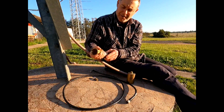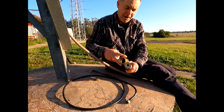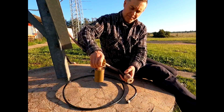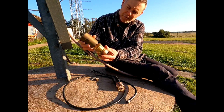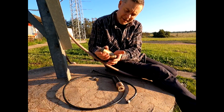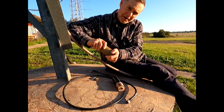The ring on the cable seals it, so it goes on there like that and sits right on the cable. Then the top part comes down and screws in. When the top part comes on, it compresses the little fingers and pushes them into the groove on the cable even tighter. It screws together and the top part of the body lines up with the bottom part, and that rubber ring seals the top part of the connector as well.